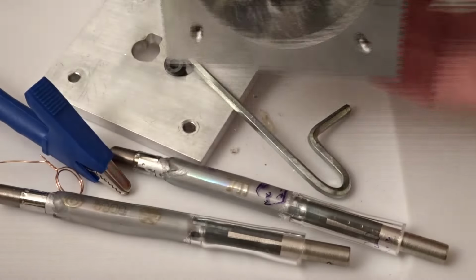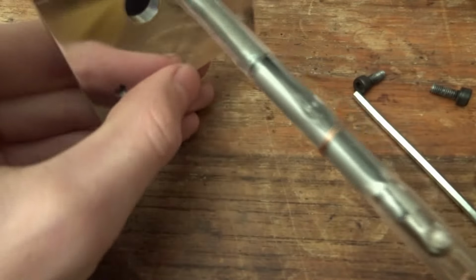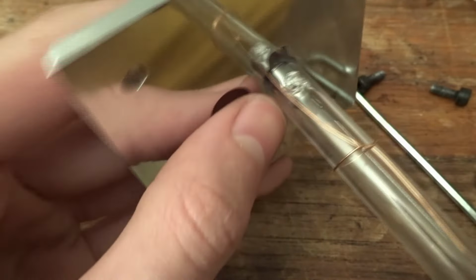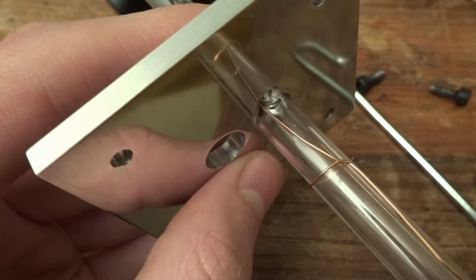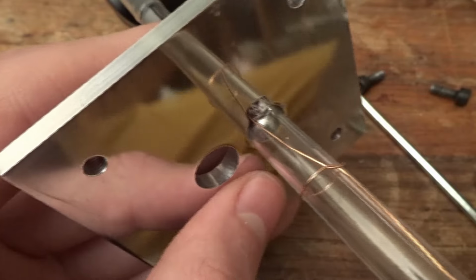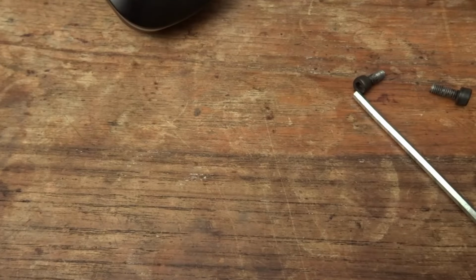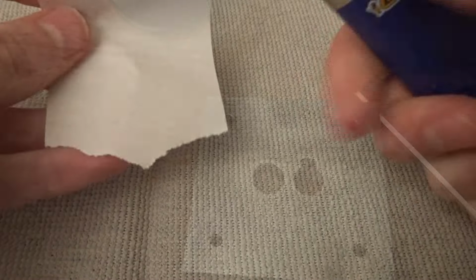I've been fighting this conductive coating from day one, they're poorly designed, I've had a few crack and the seals break. I guess I shouldn't be too surprised that 40-year-old command economy produced flash tubes are not of the highest quality, but getting a new tube is the first step I'm going to take towards getting this thing working. And yes, before anyone asks, I did try calling the manufacturer, but their number was disconnected sometime back in '91, so no luck there. With any luck, I can snag something domestic and at least made within the last decade.